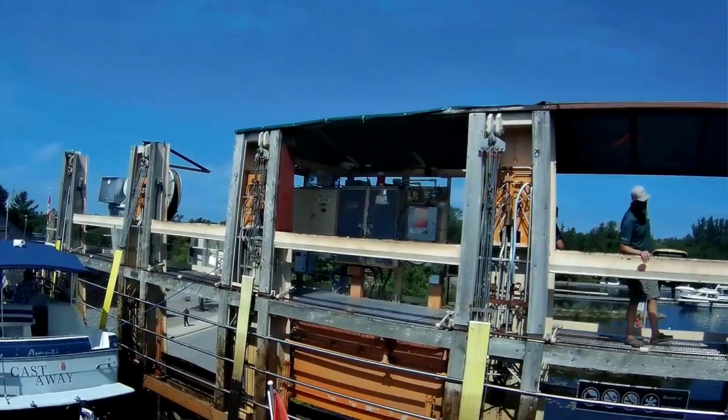The other thing that I did was to close the seacocks for the air conditioners. We have seacocks that take in raw water for the air conditioner system. We have two pumps, one pump for the two upstairs air conditioners and one pump for the three downstairs air conditioners. I closed those because it was easy to do. Why do you have to close those? In case the water drains out, and they may not be self-priming, I don't know.